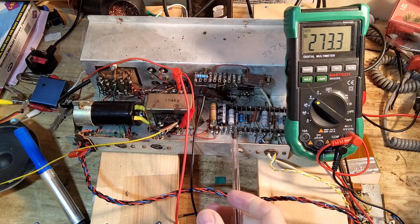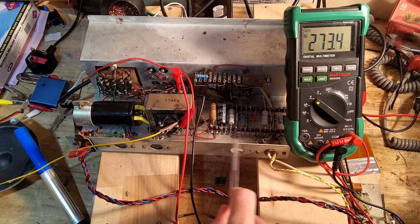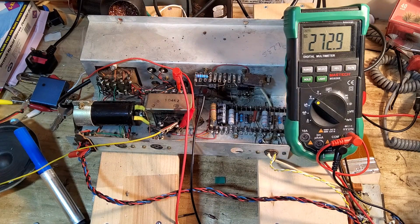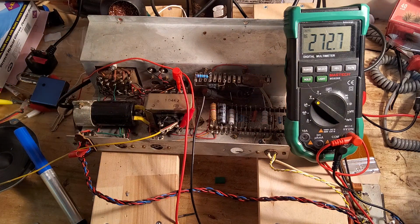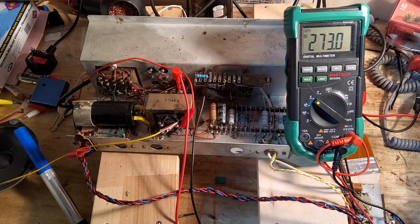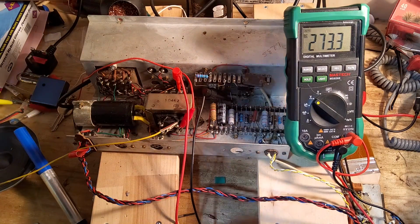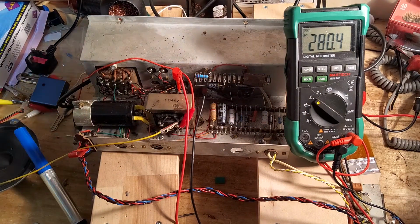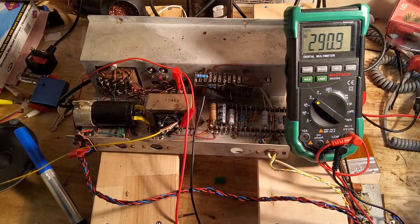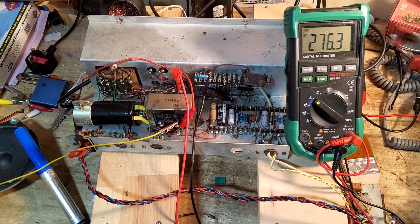Now I've got two 300 ohm cathode resistors in, one for each tube, and I did a bit of maths earlier, and this is now dissipating about 7.2 watts, roughly around 7 watts if we deduct for the screens. And this amp now is running like a song. So if we look at the input, which is here, you see now that is really loud. Got a lot of volume there. So we are pretty much good to go with that.